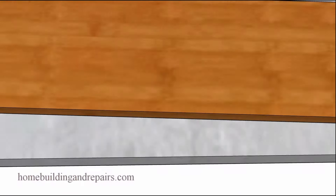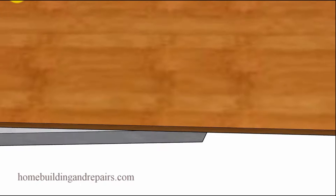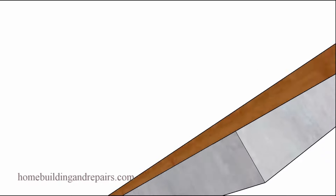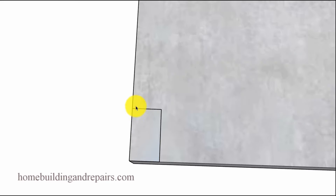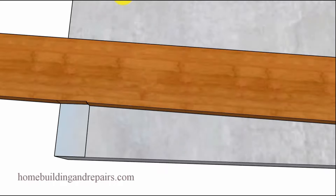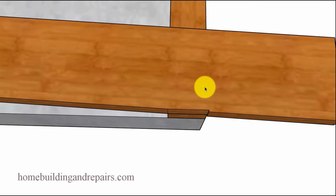Let's take a look at the bottom to explain why we need to line this part of the roof rafter up with this specific point. If you have a wall framing plate that's 3½ inches wide, you can always make a mark and line this part of the roof framing lumber up with that point. You're going to line it up with two points — this one for the upper seat cut and the one at the bottom. You could transfer the mark from top to bottom, and it will be close enough on a low slope, but that might not work with a steeper slope.